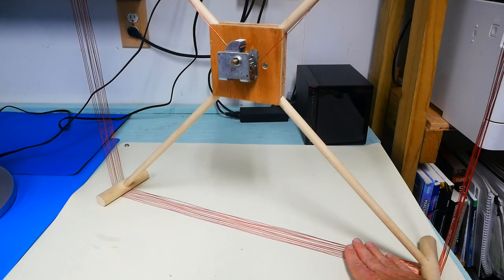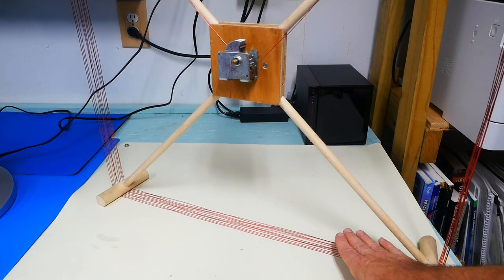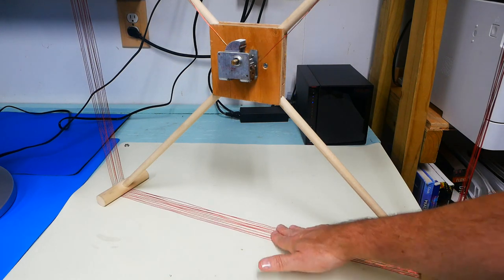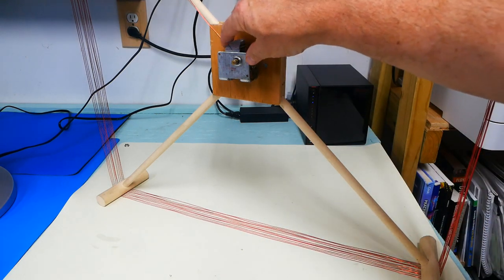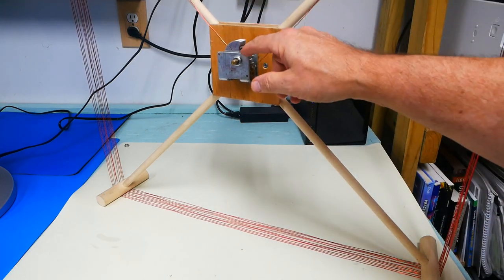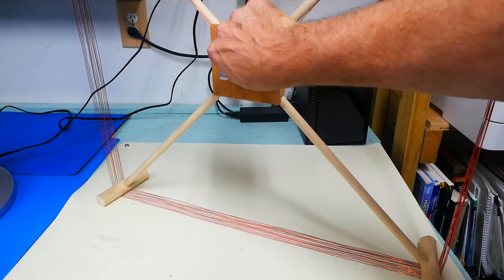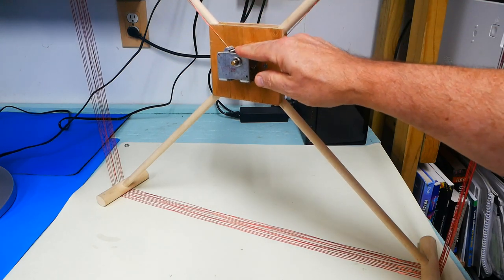The way the antenna amplifier works is that it becomes resonant at a particular frequency. That resonance is going to be determined by the value of this inductor, which will be around 200 microhenry, and the capacitor, which can vary anywhere from about 10 or 15 picofarad up to roughly 400. So by tuning the knob, I change the resonant frequency.